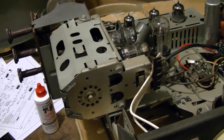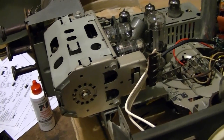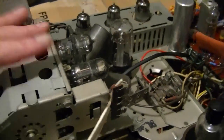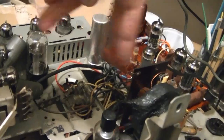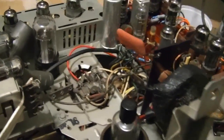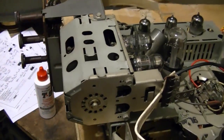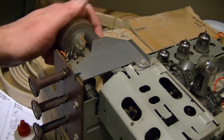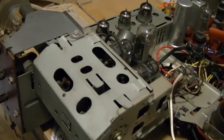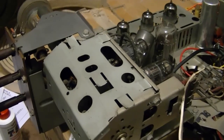My best thought is that it's not getting B+. The orange wire going to that plug goes around and around and attaches somewhere down here, probably on one of those electrolytics — and that's where I did a lot of rewiring. That's why I'm thinking that might be the cause of the problem. The final issue could just be that there's something horribly wrong with the tuner itself, but it seems a little odd that absolutely nothing happens when I change the channel. So it's got to be something pretty basic, like no power going to it.